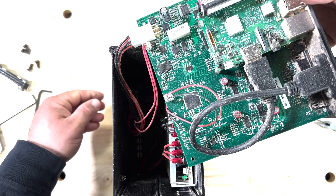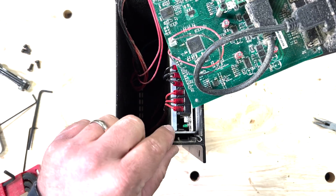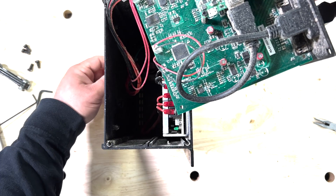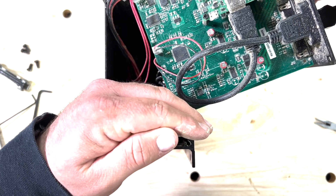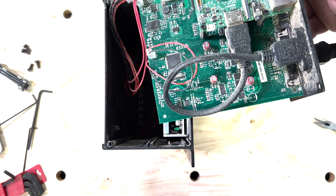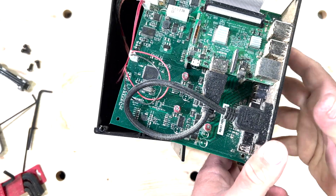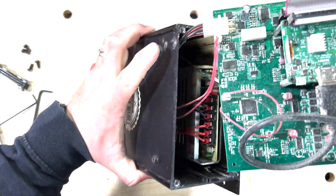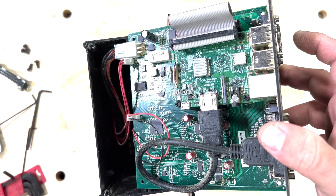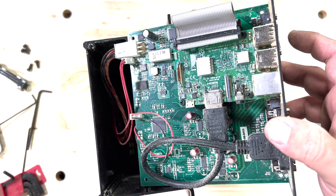They also asked me to check if a little green light — you can just barely see it in the frame — is on when the E-stop is pressed. The light is on, so that's a good sign. I'm going to go ahead and blow this out with the air compressor. They tell you specifically: do not use a vacuum on this because you'll fry the electronics — they're very sensitive.